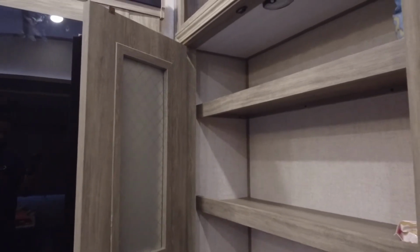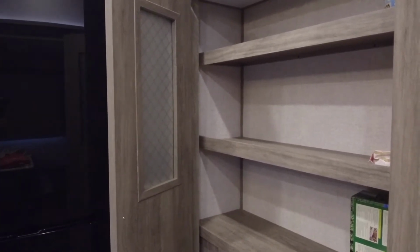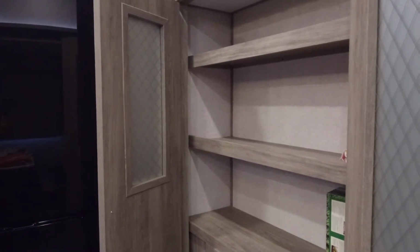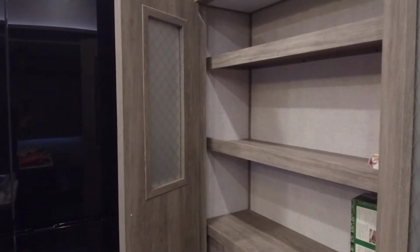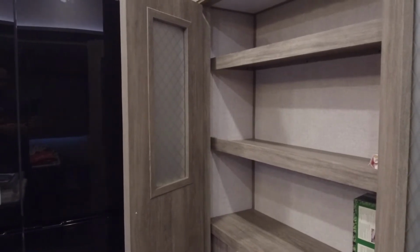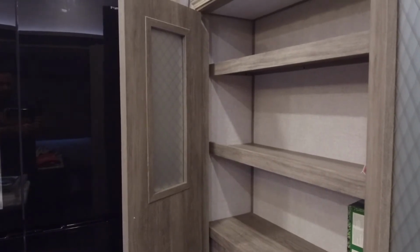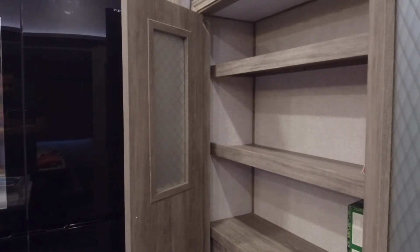So here are these shelves, and you can see here as I scroll in, they're connected. Sorry for the lighting there, but they're just kind of screwed in, 2 screws. So what I'm going to do is put a support between the shelves and then on the bottom shelf too. So I went over to Home Depot and I found some gray shelving material, like if you're going to make a shelf in your house. So I don't want to have to paint anything, and then I think it'll somewhat match. It won't look perfect, but as we're going down the road, instead of just having those screws holding it, it'll build up from the bottom shelf up to the top, and I think that will be a lot better than what we have now. So I'm going to take some measurements and get cutting on that and stick them in there and see how it works, how it looks, and keep you here along the way.